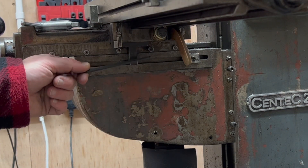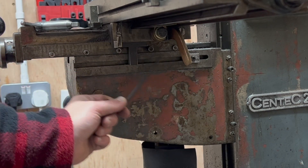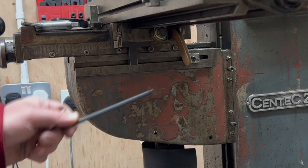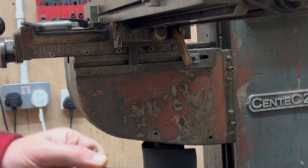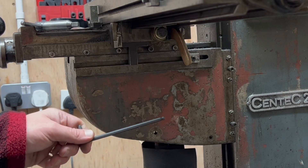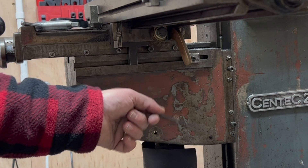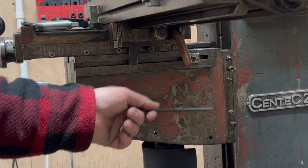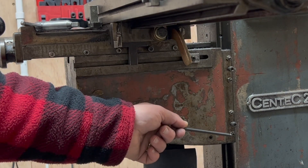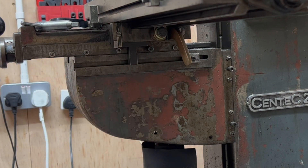Underneath here you can see the Allen head locking screws for the various axes. I'd always locked the table, particularly if I was only milling in one direction, but I was never really locking the knee — and actually that really stiffens things up a huge amount. I feel like kicking myself for not doing that. So stiffening up the knee and basically all the axes that aren't going to be used as part of an operation — right now I'm drilling, so in theory I can lock all of them. So that's what I'm going to do.